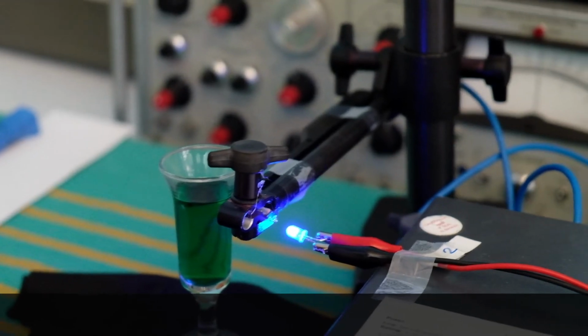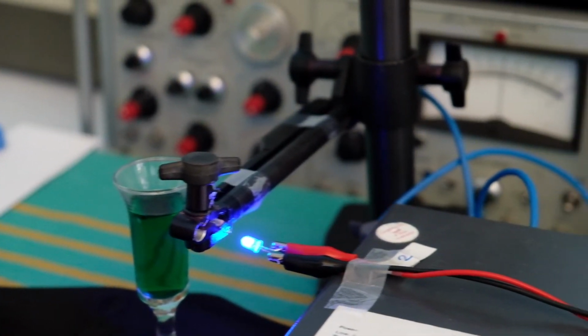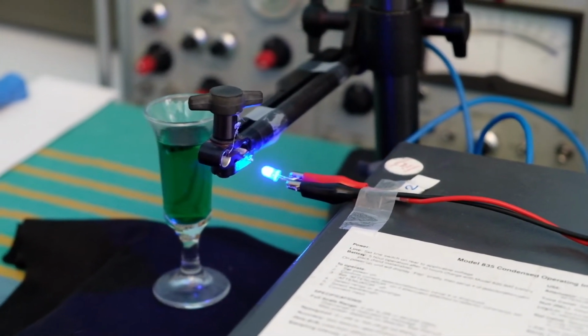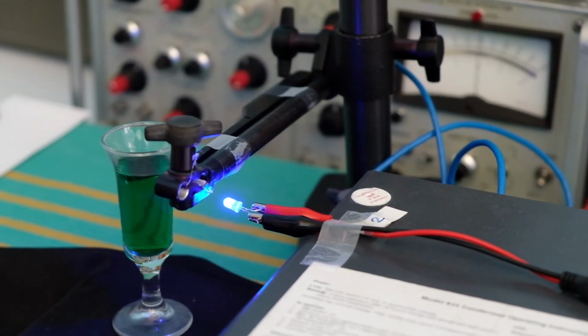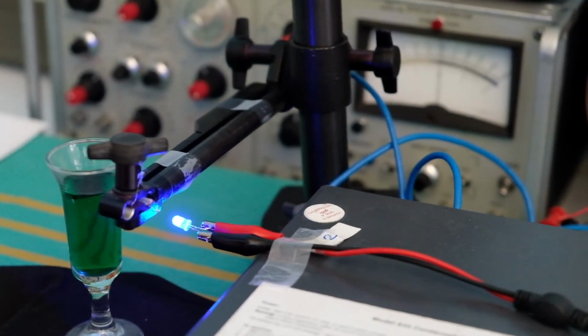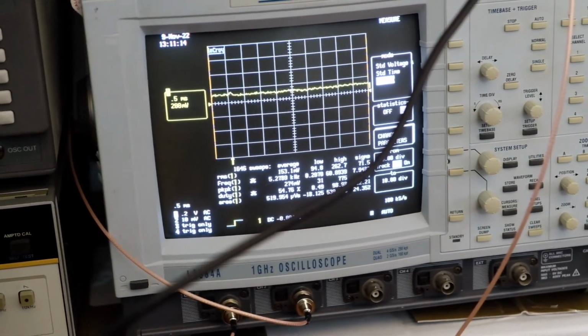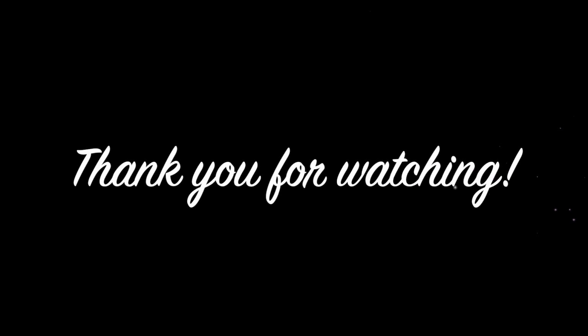So any detector that can detect this particular 10 kilohertz signal will be able to demodulate it, and it's a potential application one can think of. So here's a wild thought. Can we use this particular technique to send information across a large area? For example, shine a UV light with modulated information and project it onto some screen which is UV sensitive, and you have a bunch of receivers that can pick up the signal and produce the demodulated output, which can drive various kinds of outputs like audio or other kinds of information. I guess this is something to think about. So this ends this video, and I hope you enjoyed it. See you next time.